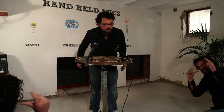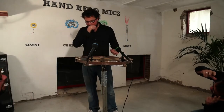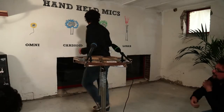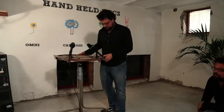This is supercardioid, hello, testing, testing. This is cardioid, testing, testing, hello, hello. Click, click, click. As the supercardioid microphone is less sensitive on the sides, but has its little bunny tail of sensitivity in the back of the microphone, it picks up quite a bit of the clicking sound of the photographers. Click. Where the cardioid one does not have the sensitive tail and leaves out the clicking.